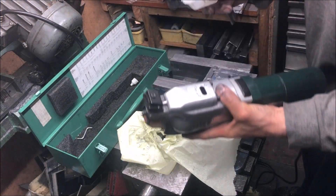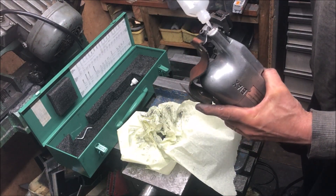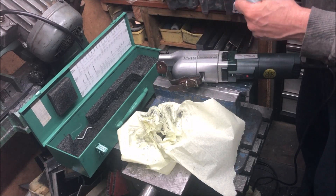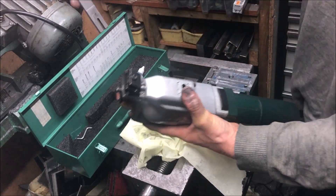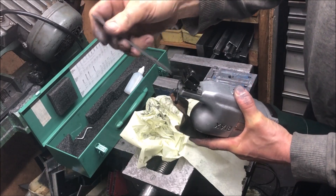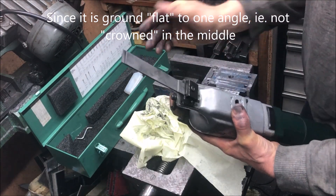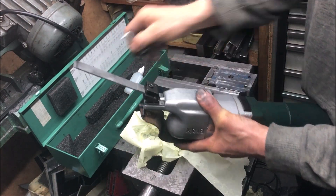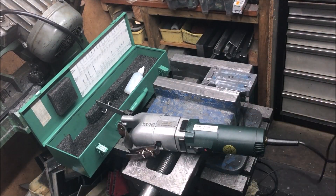You get slivers rather than the nice cast iron swarf. Since this is an expensive machine I try to be gentle with it, so you can have it for a lifetime. I lube it up each time I use it. You can also set the stroke length here — just remember to set it the correct way: now that you don't have equal angles you can't flip it around. Just snug this up — it doesn't have to be super tight. Then set the speed and plug it in.